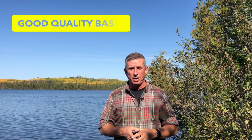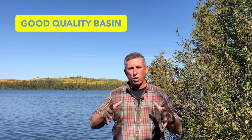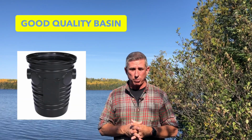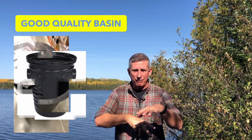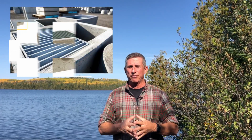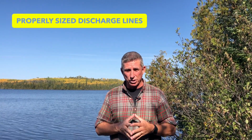Okay, some key components, some parts. We talked about the pump. We talked about a good quality basin. Now, the ones they sell at the box stores, I've used them and they work perfectly fine, provided that you backfill correctly around them after you dig the hole out. There's other ones that you can get that are higher priced. You can even get some cement ones like you're seeing right here. Now, those are pricey and they also are very heavy, so you have to know what you're capable of. Also consider some properly sized discharge lines.